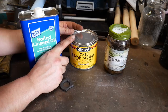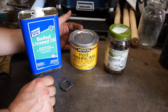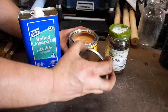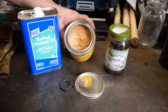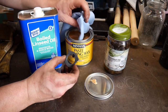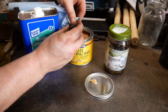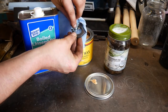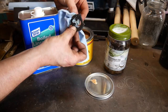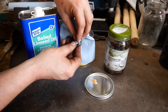Last but not least, let's talk about the paste wax — this paste finishing wax. This actually goes on at no heat at all; you just rub it on the surface of the material. It comes in a can like you see here. Let me go ahead and open this up — as you can see, it's just a paste. What you do is take a little bit of towel and work a little of this paste wax onto the piece. This one has already been coated with boiled linseed oil. It's really soft and you just wax it down. It's a lot like an automotive wax — you wipe it on and then buff it off. If you take it to a buffing wheel, like a loose-leaf buff, it will give it quite a sheen and almost make it look like a painted surface.